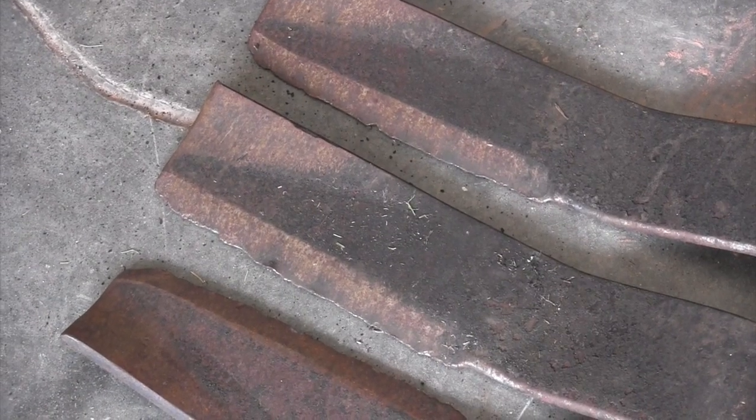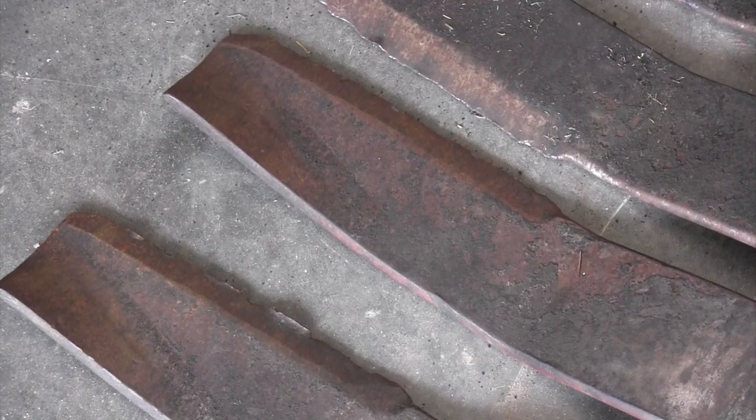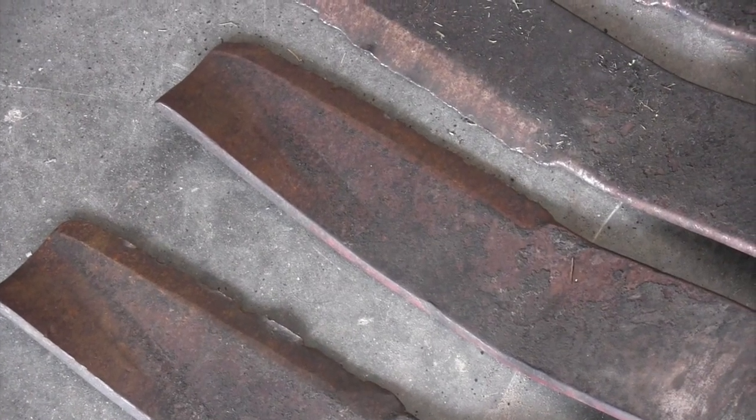So your best advice for somebody whose cutter is getting some wear — when do I sharpen my blades, do I ever sharpen my blades? They look good to me. One side is more worn than the other, but it looks like somebody had changed just one set. It's not uncommon to change one set — somebody might break one blade and buy a pair. You want to run even on each blade so you don't ruin the bearing and the spindle. My first brush hog the damage was done to the skirt — I hit so many rocks that the skirt came right off, and we still haven't sharpened the blades.